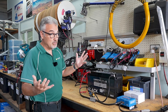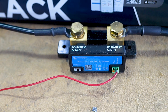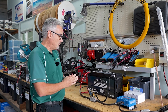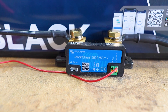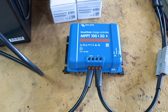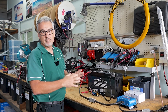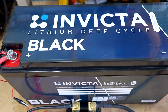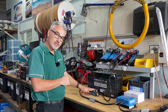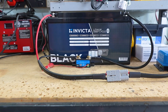Then all you have is a little positive cable so that it obviously powers up the Smart Shunt and gives it the voltage reading. We've done a simple setup where we've just got the Smart Shunt connecting through to a solar regulator, solar panel on the roof, and we're just charging a battery with no load connected to the system. It's really critical that you only have the one cable going from your battery to the Smart Shunt, and then everything else needs to be on the other side.